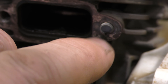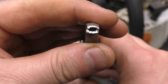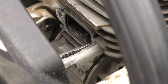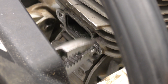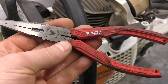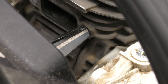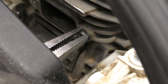I'm hoping it won't be a big deal to get it out, but you just never know. The good thing about this screw is that there is some of it sticking out. My first go-to tool for this repair is a pair of vamp pliers. They work well for this type of screw removal because they have serrations vertically and are rounded at the end, so they fit perfectly on broken screws. It's actually pretty hard to grab hold of that screw. I do have another pair — needle nose vamp pliers with a smaller hole at the tip. Hopefully this will work.